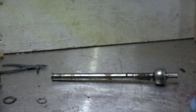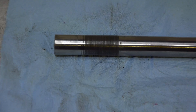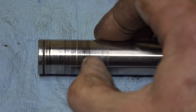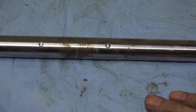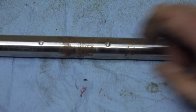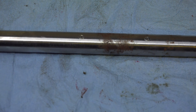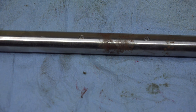It's tight — it's not going to come off of there easily. I've got the shaft cleaned up a little bit and you can see where that bearing seized. This has pretty much trashed this shaft on one side, but where the other bearing was, it's really not bad at all. Also, they didn't cut any flats on this shaft for the blower wheel set screws — they only cut a flat for the pulley. That's sloppy work by the manufacturer; there should be flats there. Because the set screws dig in, sometimes that shaft can be heck to get out.